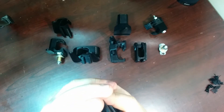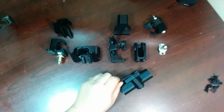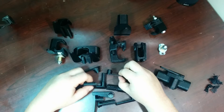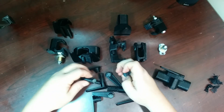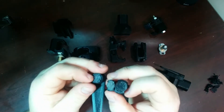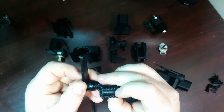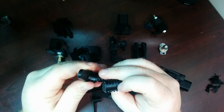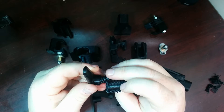So this was my first stumbling block in this design: how much force is enough to keep it tight, and how much is too much force? With too much force, the pin broke — and when I mean broke, it broke. This is just a handful of the ones I printed. You can see that when they broke, it was always at the heel of it, right at the bottom. Because there is a moment being placed on it, so it's not being pulled straight across — it's being levered on one of the edges, and then the crack propagates and it just rips.